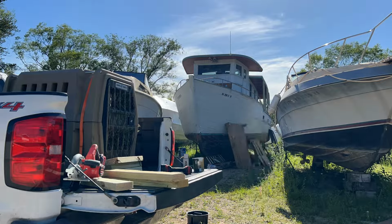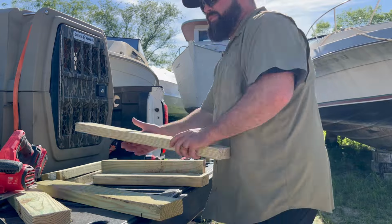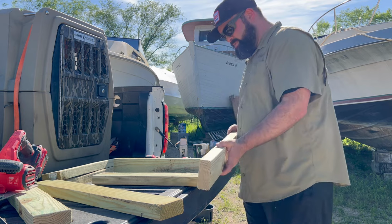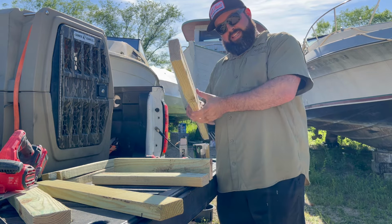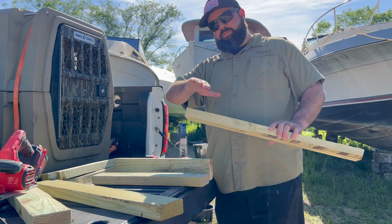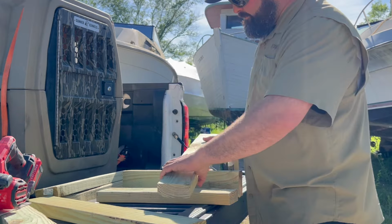Got everything cut. I got the boards cut. Got the legs upstairs. I got cross members, four cross members, four long pieces. So I'll cut the size. I measured it up there. I'm gonna build this, then take it, set it on top of the plywood, trace it out, cut out the plywood, then tack the plywood to the table. You following? If you're not following, just come on. Let's do it.